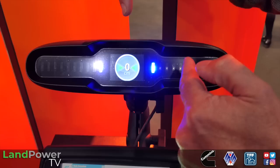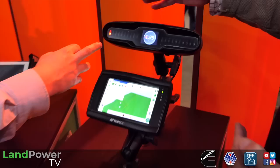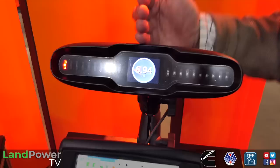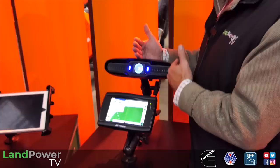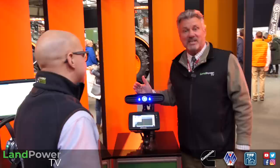This screen here - it's your guidance bar, tells you if you're in the middle? That's it - it will change as you deviate offline. You've got the cross-track error in the middle and the LEDs either side to notify you of exactly where you are. You could use this mounted inside the cab or outside - they're all IP rated so it can go outdoors. You can suction-cup it to the bonnet if you really wanted to. It still works on the same receiver system - all the same.